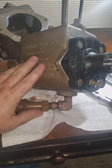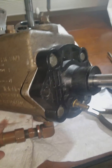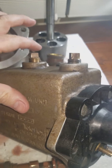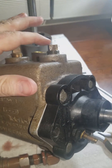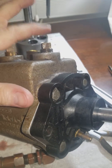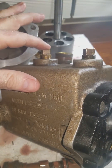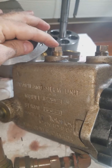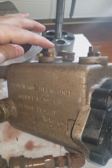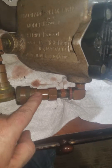This unit I've already rebuilt and reassembled. Because it's a fly bridge unit, there are no connections on top. Because this is the highest unit and the whole system is gravity-based, this is where you would add oil. This one stays capped. This is used in the center console unit, because this one feeds it from up top — so they're interconnected.